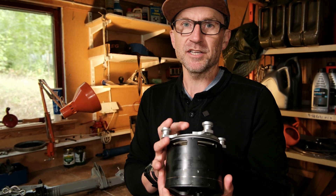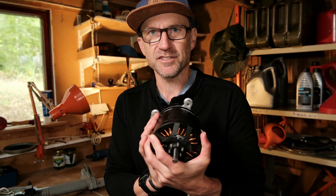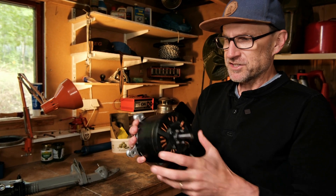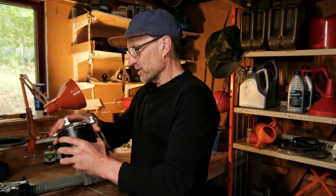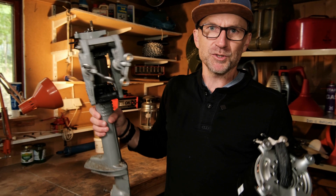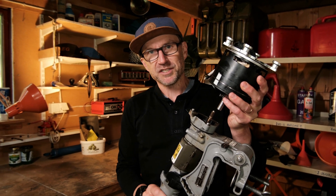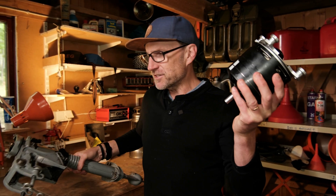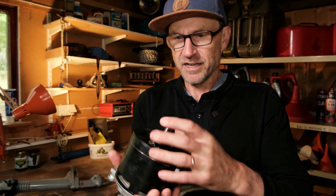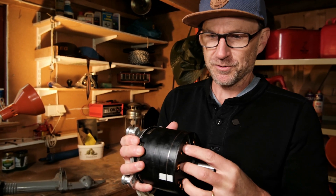The 12 kilowatts is actually achievable and this thing does it really well. But it doesn't stop there, because the next issue is you need it to turn at around about 5,000 revs a minute for the bottom unit — which is what we just explained and what you're going to look for. How do you know this thing actually does 5,000 revs? Well, it's got to do with the windings — something which is referred to as KV.